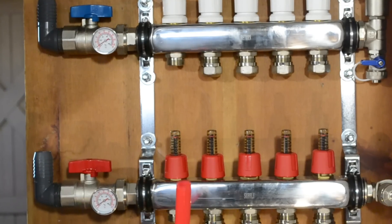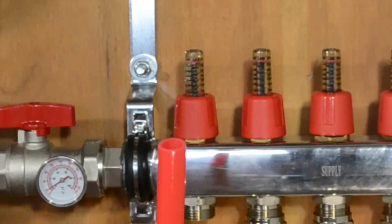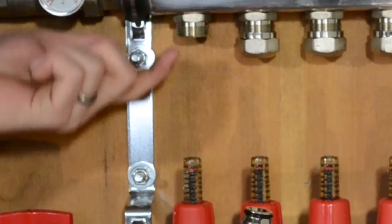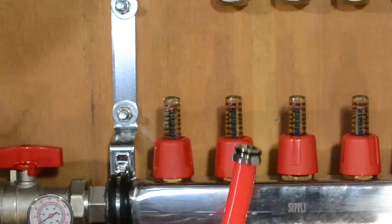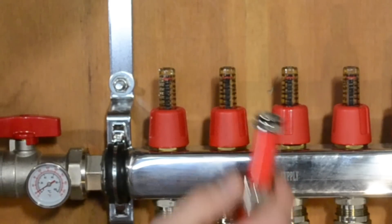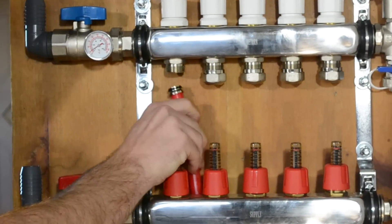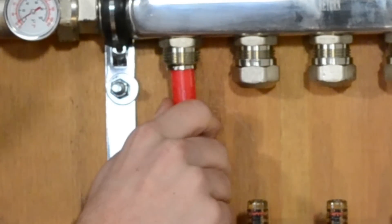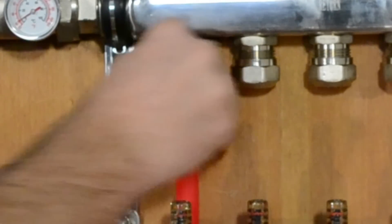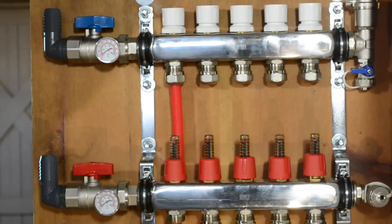Take your nut and place it over the end of your PEX, then take your compression ring and fit that over next, then take your nipple and seat it down in. The O-ring will seat in here, and the compression ring will clip closed around the nipple — all done by screwing the nut in. Make sure everything is seated and even, then tighten it up. Push up while you're tightening down so everything stays seated. And there you go — you've got your first connection in.